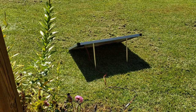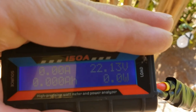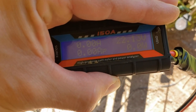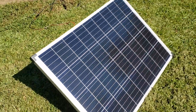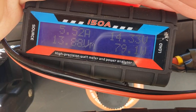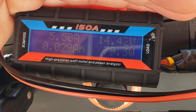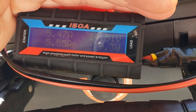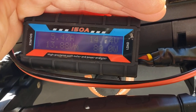The panel is sitting out there with no load. As you can see, it's showing 22 volts open circuit, so the panel is still doing well. With no load it's still producing what it's supposed to. For fairness I left it dirty, so I'll check it dirty and clean at different angles to see what the wattage is. It's drawing 5.5 amps at 79 watts and 14.45 volts — it looks like it's still performing exactly where it's supposed to.